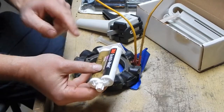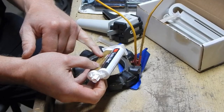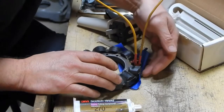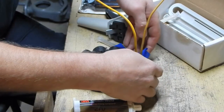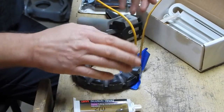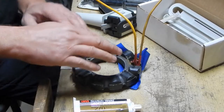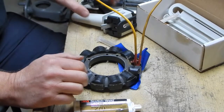I don't know how viscous this stuff is - it is an epoxy potting compound and adhesive, black in color, though they also have it in white or clear. Not knowing how much it's going to flow, I'm going to tape the bottom with painter's tape so hopefully it won't flow out everywhere. I might just do this in two parts - flow some in and if it behaves I'll do it all in one shot, or I may just coat the windings initially and wait for that to set up before doing another pour.